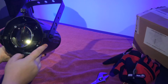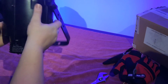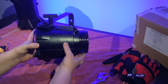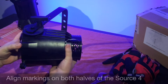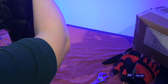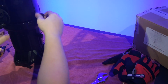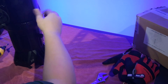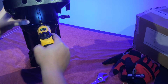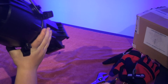There you go — there's the front end of the HP LED conversion inside of the Source Four, and there's the back end. Next, we're going to take the main unit and connect it to the lens. You'll notice that there are small arrows on both the unit housing and the lens — you want to line those up, just like that. Then turn it sideways until it drops down, line those back up again, and then screw down both screws. And there you have it — an HP LED inside of a Source Four.